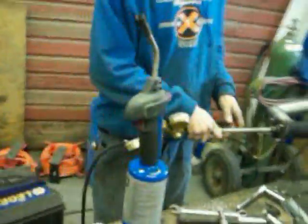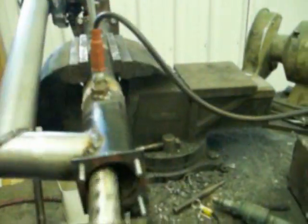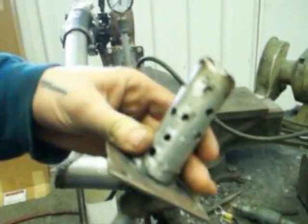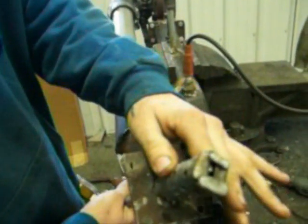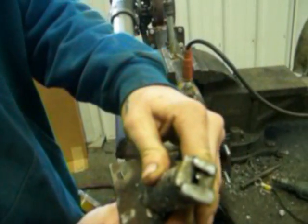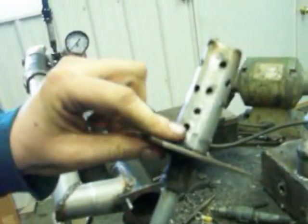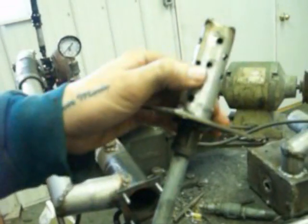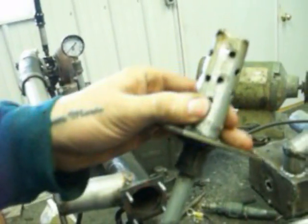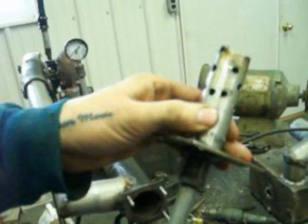Combustion LP injection. We just welded a flange that bolts right on. This is the ground for the spark plug, goes to the coil. It's inch conduit with a bunch of 1/4-inch holes drilled in it, and we cut 4 slices and capped the end over a little bit like so. Inside of here is a compression fitting, 1/4-inch pipe on one side, and there's a .035 welding nozzle on the inside, which the LP comes through.